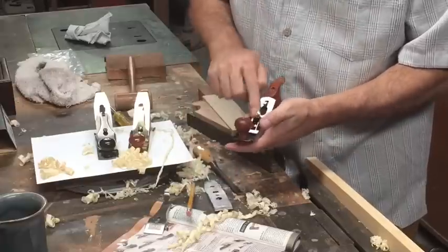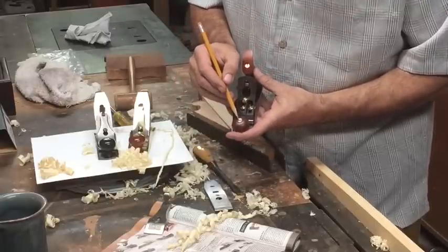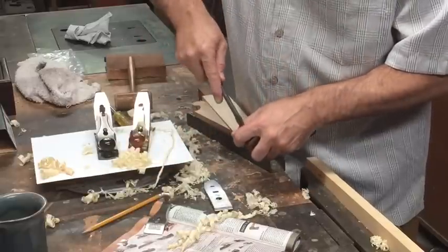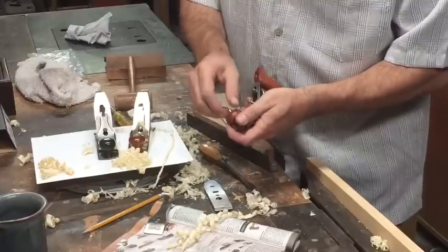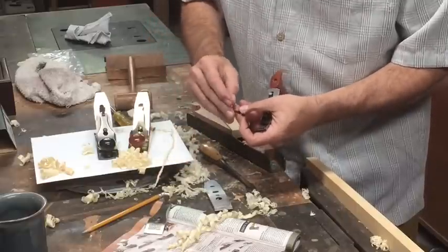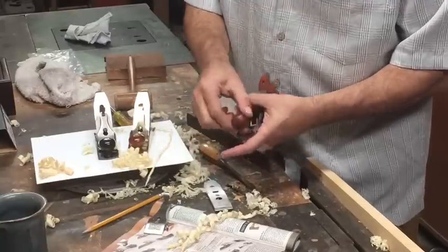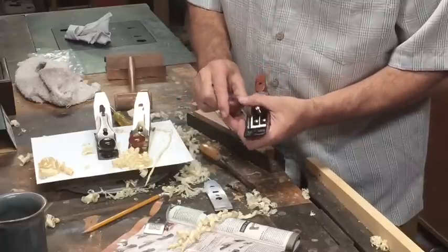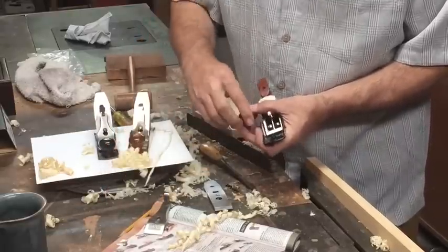Here's our blade. Everything's nicely oiled in here. The screw sits in here, but you can see it's leaving a gap, which means either this is out of round or the screw might be a little bent. When I got the plane out of the box, both of these rattled, and I went ahead and tightened them up. There are two washers on this piece — I wouldn't think there'd be a need for that unless there was some issue with the drilling of this hole. I can see that this hole is not properly round; it's been offset in the drilling.